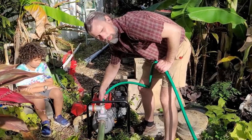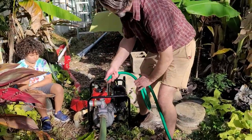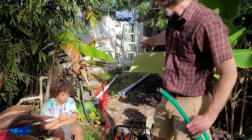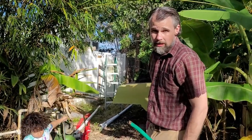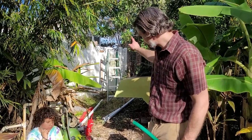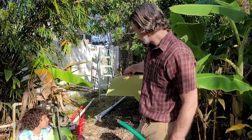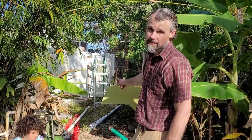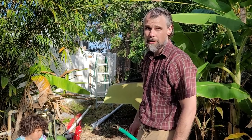Alright, so we have our pool kind of filled up. We've got all our hoses hooked up, and we've got our first piece of drill stem hooked to the drill head we made. And we started a little 2 foot hole, just marking where we're going to put in the wells. So at this point, we're going to fire it up and we'll drill the first section down to about 10 foot, turn it off, pull the head, attach the next pipe, drill it 10 more feet, kill the pump, add the next piece, and drill it down to 28 foot, hopefully.